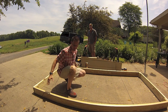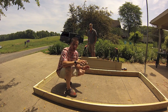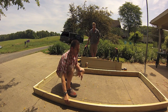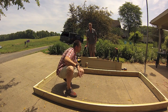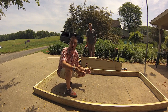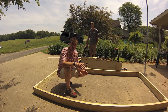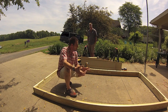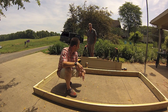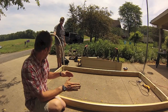The basic shape of our pen is just five feet by ten feet. We've got treated two-by-sixes that we've made a base frame out of. Unlike a lot of game bird pens, this pen is going to sit directly on the ground, so we're keeping it very simple. We put cleats in the ends and now all we've got to do is screw our long boards into the cleats themselves and we'll have our base frame made.